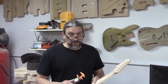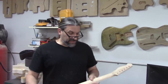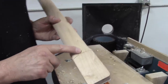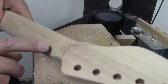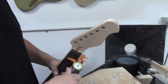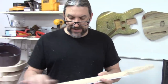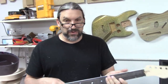The Deadhead Sander is a really old school tool — they used to use them in factories in the 50s and probably all the way through the 80s and into the 90s in some places. Ours is a shop-made tool, made so that we could put a whole neck on here and just shape the whole thing. There's my line that I want to match — I'm getting pretty close. At the first fret I'm about 850, and at the 12th fret I'm right at 900. That's kind of an old school C shape, and we've got a little more shaping to do. I'm going to finish up on the Deadhead Sander everything I can get sorted out, and then we'll do a little bit of handwork.